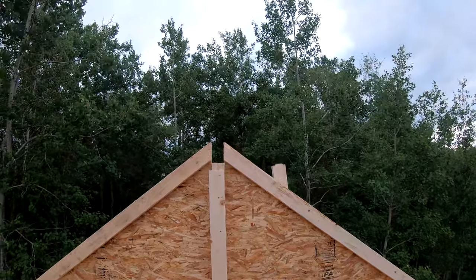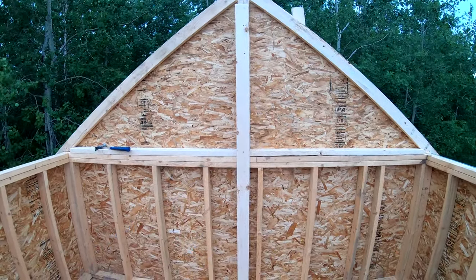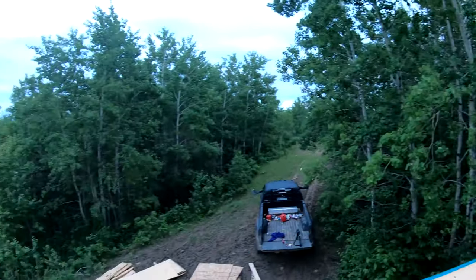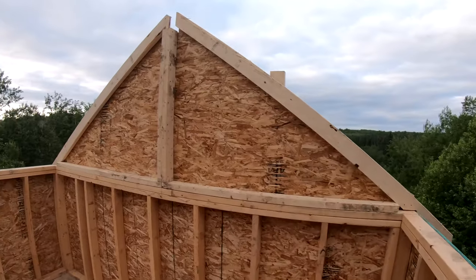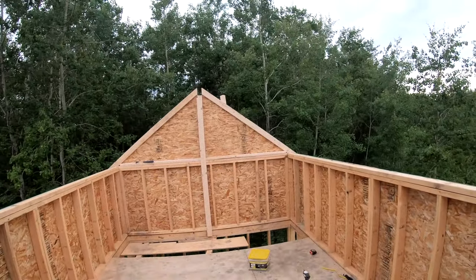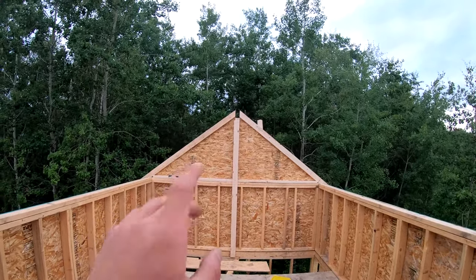I did a much better job on this side on the plywood gap. Don't pay any attention to this board up the center — it's just an alignment board to make sure everything's going up straight. Yeah, it's starting to look like a house — a pretty redneck one at that. So what we're going to do now is put up this here ridge board, not a ridge beam — two different things. This is a ridge board, and I'm going to make it out of two 2x6s — actually four of them.